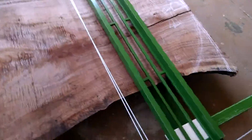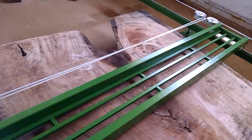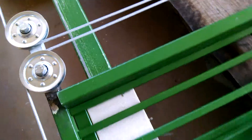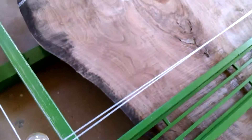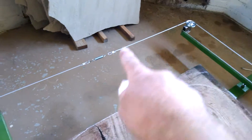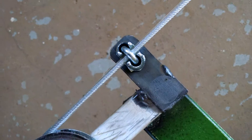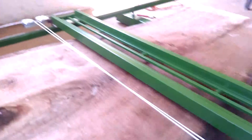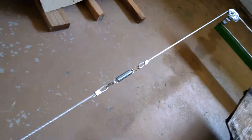You can push on the router sled with like one finger and it stays square, because the cable that's pinned to this ends up running through the pulleys to that point and around to the spring, which provides tension. And then this is key — this little clamp here. Once you get the sled set square, you clamp this down, and the spring still keeps tension in the system.